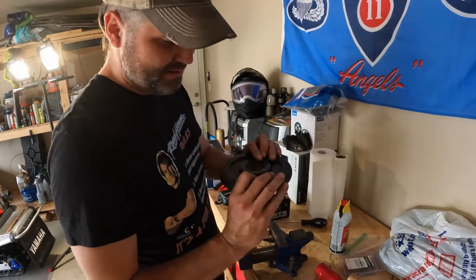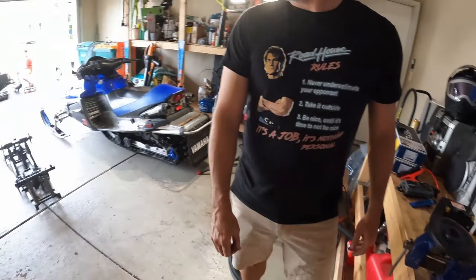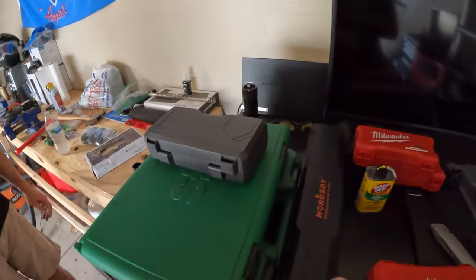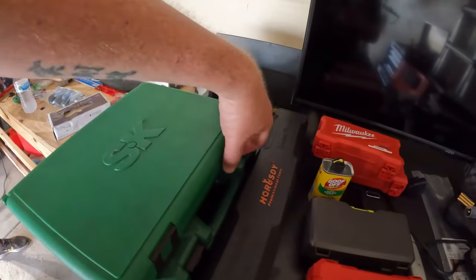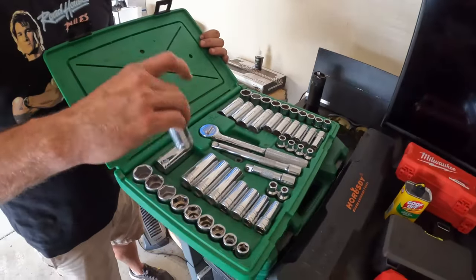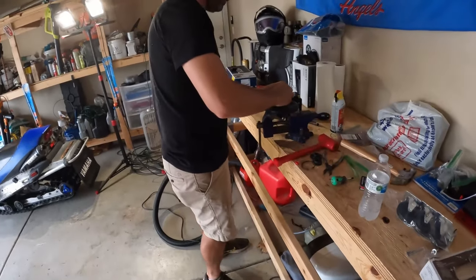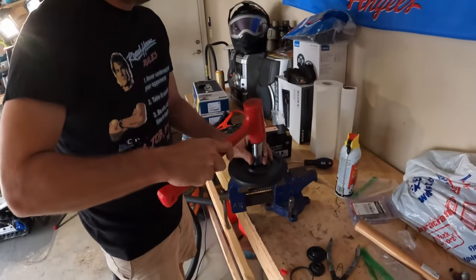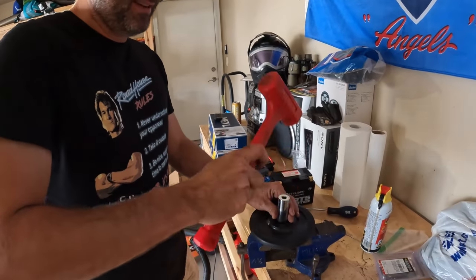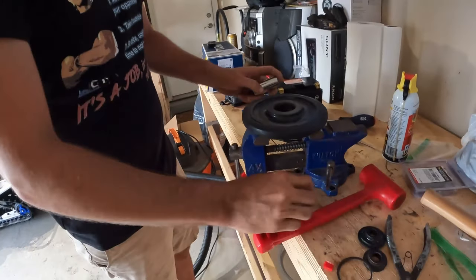So now you've got this bearing. Easiest way, go over to the little ratchet set. What do we want? That looks like a winner there. We're going to go with the 13/16. Okay. Oh, just big enough. You found a standard size? I did. The nice thing is you don't have to be careful because you're replacing this bearing. So just pound it out.